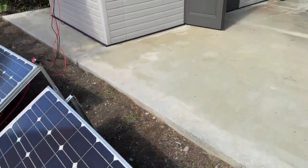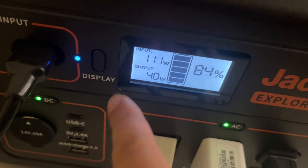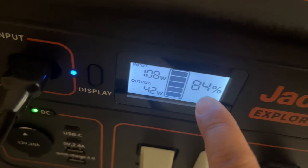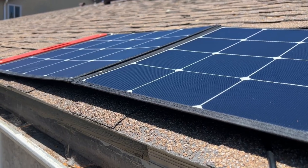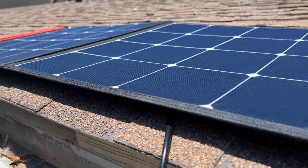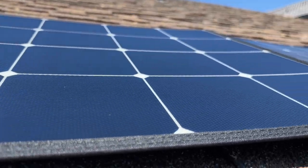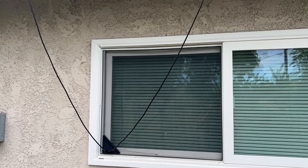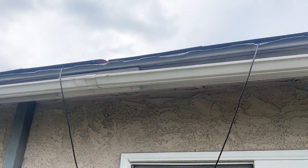So I have two examples of this. This is my first setup powered by a solar generator, which is able to hold 1000 watts, and that's enough to power this small grow setup for about a day. When connected with 200 watts of solar panels, it's pretty much completely self-sufficient, and I have it set up with the power plugged in as a backup, which will top off the battery every day between 7-12pm, just in case it was a rainy or cloudy day.